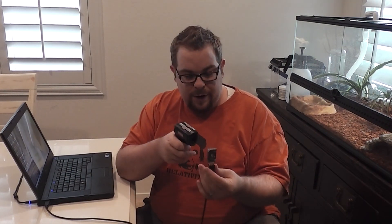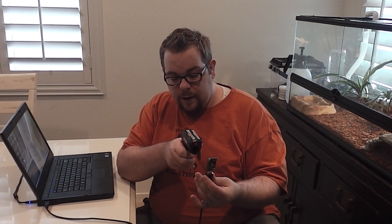I've got a thermometer here that is putting it at 136.5 degrees Fahrenheit. I mean, it's not burn-you hot, but it is interior-of-your-car-on-an-extremely-hot-summer-day hot. It will startle the living daylights out of you if you just try to grab it and yank it out, especially the little aluminum heat spreader on the back — that side is 136 degrees, and the PCB side is only 125. So be very careful when you take this thing out. It is a miner — it's supposed to just be plugged in and forgotten about. But if you go to do any maintenance, be careful.